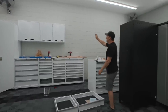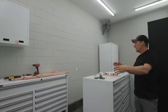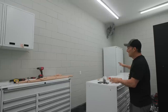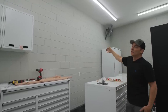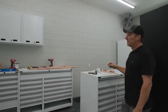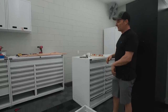I've got a level line. This is where the uppers are going to stop here and then we're going to have a gap for the TV which goes in the center. I've got these all done. The next thing is we need to set the closet distance based off of the bases. I'll probably do the bases next, get the closet installed, and then build off of the closet for the next three uppers - that way we have a nice tight fit. Even an eighth inch off won't look right because there'll be a gap at the reveal.